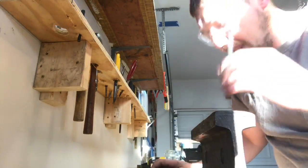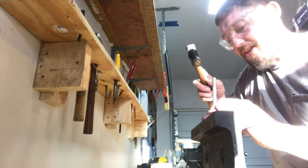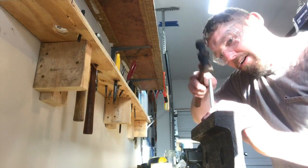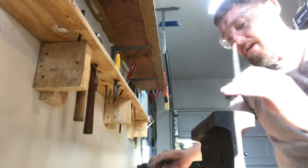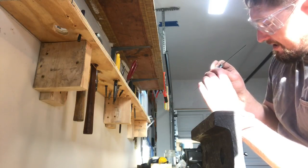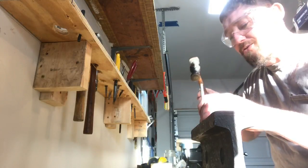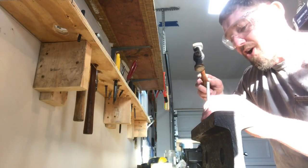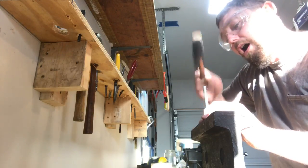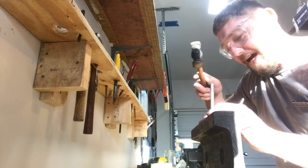I think much more production can be done if you make flat framed harps with screwed reeds, because that would just make the adjustment so much easier. You have to worry about spring back on metal, how much it's deforming. But making a harp like that isn't really an option, like a Glazurin style harp, for us in our small shops. All those harps are laser cut, and I think milled out as well. And I do really like Glazurin harps, especially the Batman, the Alpha, fantastic.